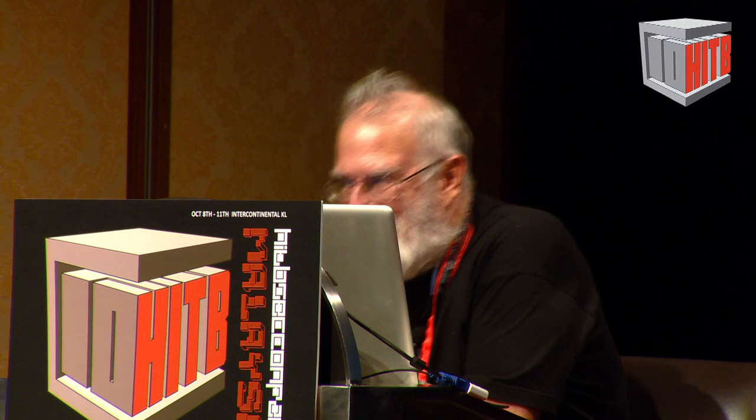That's it. That's a very, very long stack. It took quite a bit of time to set that up. But every time you hear that little chirp, what's happening is there's one telephone link that's just collapsing down after you've disconnected. What you're listening to is the called phone, the phone that you called. When you hang up the calling phone, you just listen to the called phone, and that's where you heard all that collapsing go down. It just kept getting closer and closer to your call until finally the last trunk completely goes away. Bing! And then it's done. That connection is collapsed, and that was the whole thing.